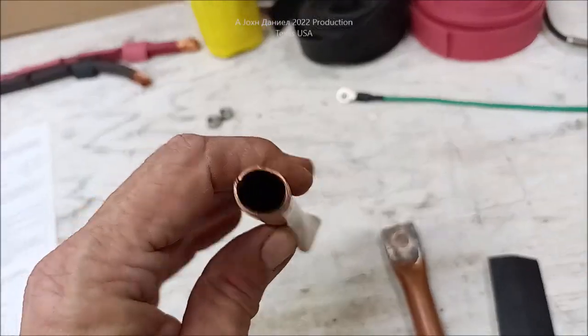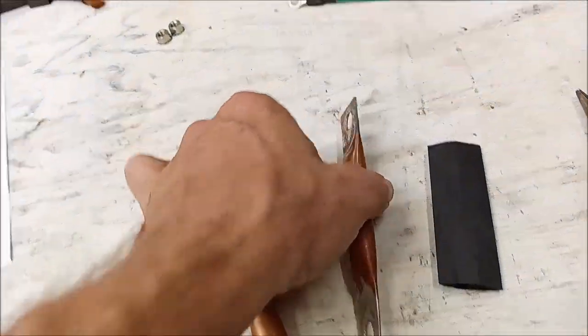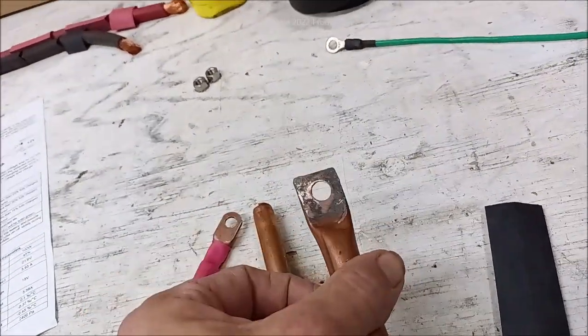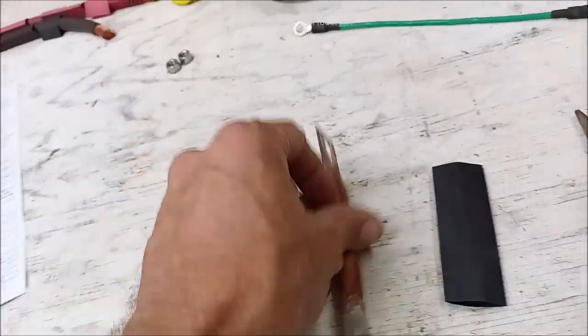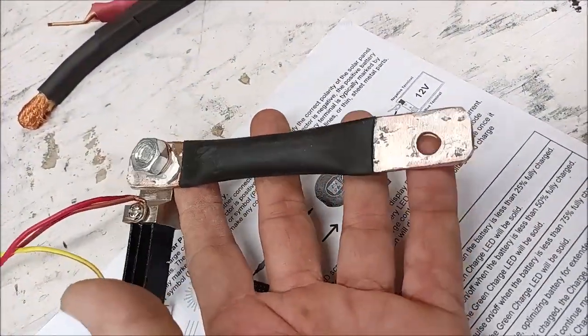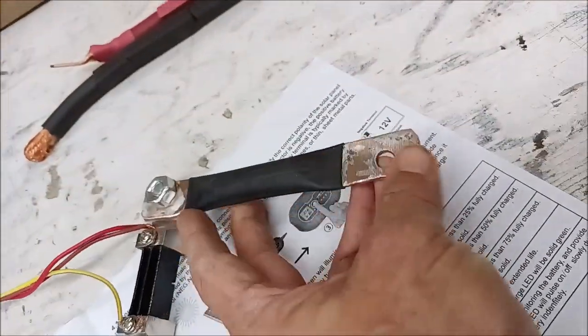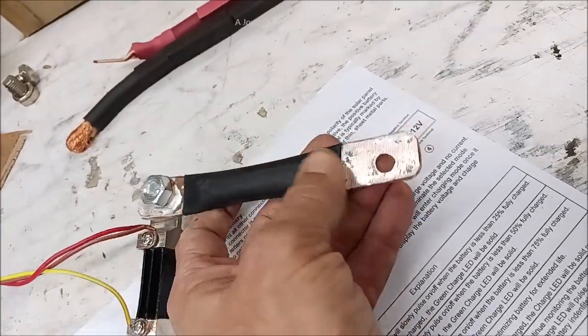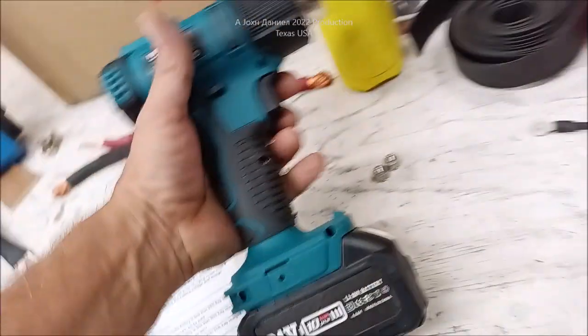In this video I'm going to show you how I ended up with this result. This here is nothing but type L soft copper. You see this bus bar — it was simply tinned with a little bit of solder, and you do that so that you don't get oxidation on it. Here you'll see this bus bar, an older model I made so I could use on my large shunt to get it away from the battery and make easier contacts. Similar thing — shrink tape on it — and we're going to be introducing my little friend.